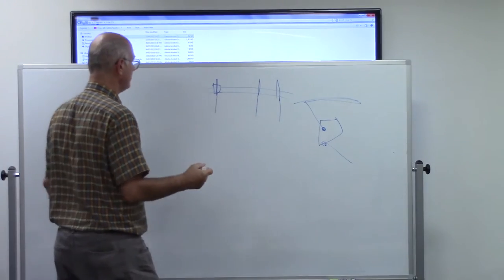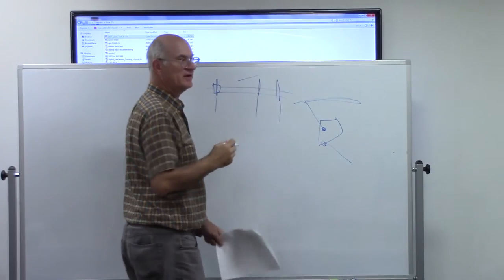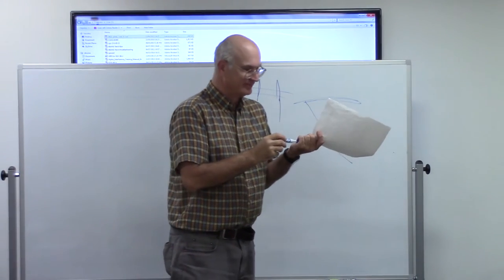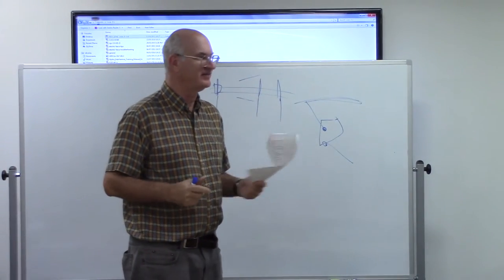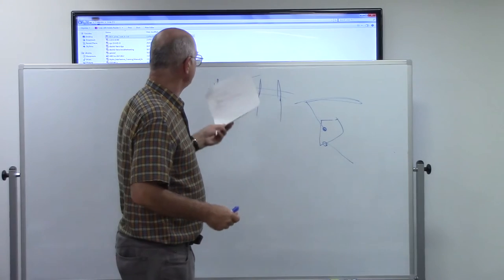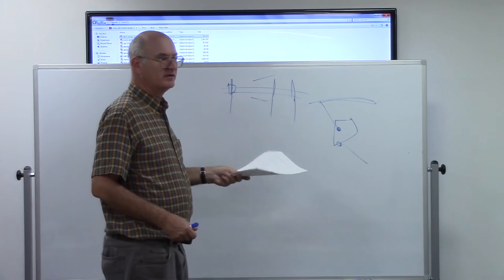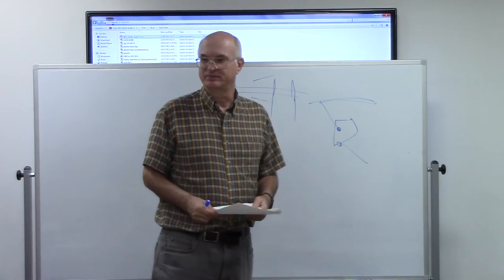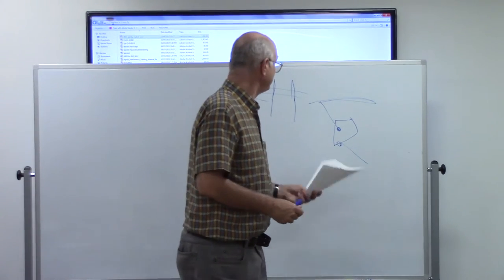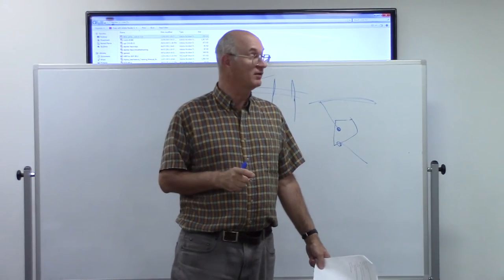And if you're putting up a dipole antenna, and you have a choice of gaining a few feet by going over a power line, as opposed to under the power line, go under. Take my advice and go under. Take the hit. Because this other hit is much worse. If that line should break in a windstorm, come down, it will discharge into all your equipment and anything else that happens to be in contact with it. And that's not a pleasant result. So I can't stress that enough. When you're putting something up, you're working on a tower, know where those power lines are and stay the heck away from them.